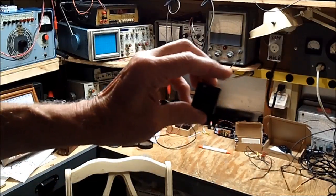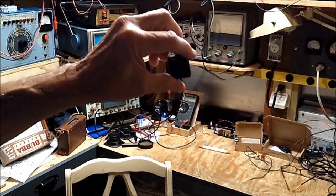Uncle Dorkle is going to have only two speakers: the five-inch subwoofer that's in his belly and the two-inch by four-inch in his chest. I need a monaural amplifier — with solid state you don't parallel the channels like you could with vacuum tube equipment. I can use one channel, not a problem, but I need one or two watts. I don't think that little amp is going to be enough power.